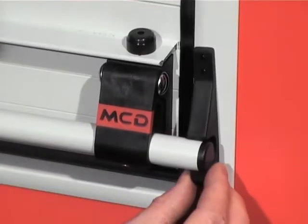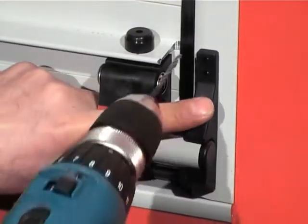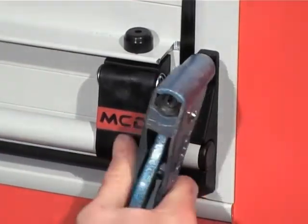Now close the shutter until compression of about a third of the bottom waterproof seal, and position the blocking strikers at the far end of the bar. Drill and fix them by using the clinches in the packet of accessories.